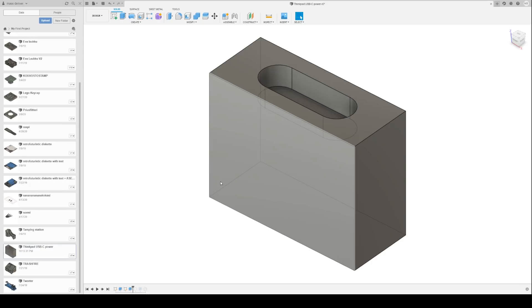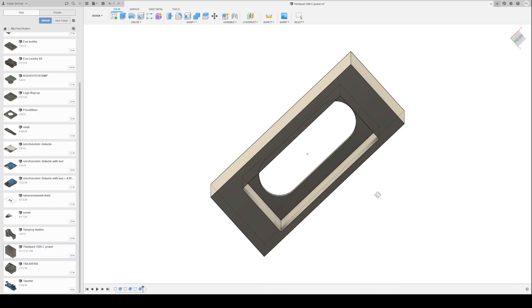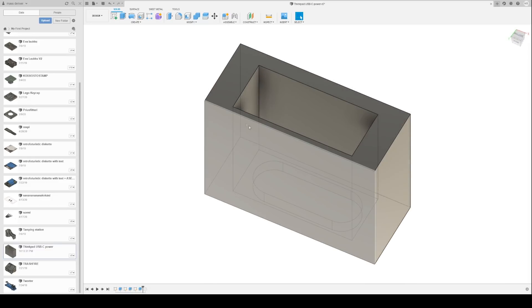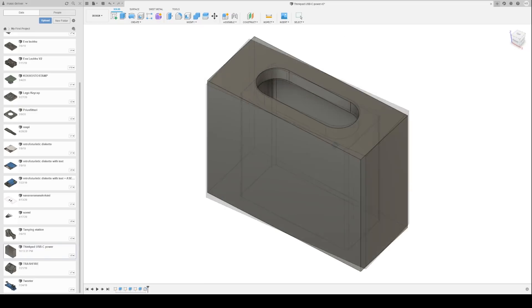Even then we need to do a little extra work — we need to use a knife or some sandpaper to carve out these areas just a tiny bit. The margin of error is very close, so that we get a very snug fit. Then we have the actual hole where all the electronics will sit, which is pretty much the right size. I had to do a couple of different versions, each time increasing it a little bit so I could fit the chip inside. I also added some fillets to the ends, because 3D printers don't like 90-degree angles. That's the housing for the power delivery module.